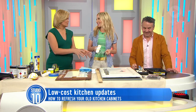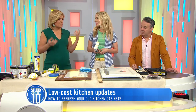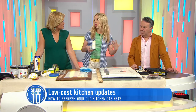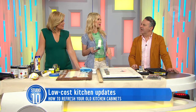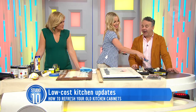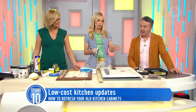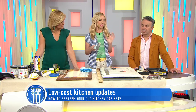This grey is really on trend at the moment. A lot of people go for white kitchens for longevity — it freshens up a space. But grey is a classic colour. There are certain colours that will always stand the test of time: whites, creams, stones, greys. I would never paint a kitchen purple or green because if you're going to be selling or renting, you don't want a buyer to come through and be put off. Kitchen fats tend to stick to old wooden doors — does this paint make it easier to clean? It does. These are specialty paints designed specifically for laminate, so you've got to make sure you use the laminate primer and laminate paint.